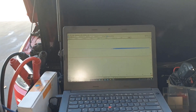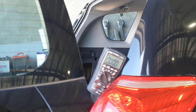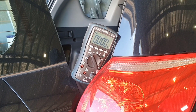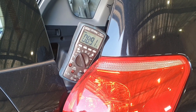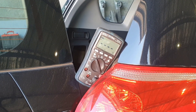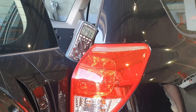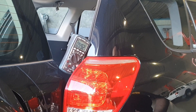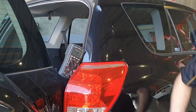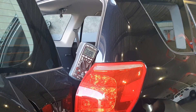To show you what it looks like on a multimeter, I'm going to disconnect the scope and plug the multimeter into those same connectors. Right now we're on DC — 10 volts, 8.9. So that's our first test and it's a good one. When I spin the wheel you can see we're getting a very slight change, but you could not tell me if something is wrong with a magnet or anything like that. The reading is around 9 volts — I reckon it should be 10. You can see it changes as I spin the wheel, but you can't get much detail and you certainly can't tell me anything about the bearing.